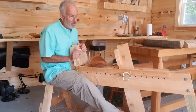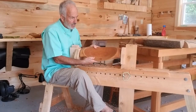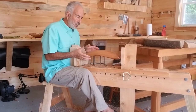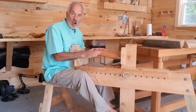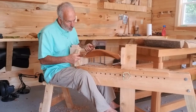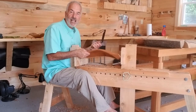I also want to show you how I use the draw knife and the carving horse to fine-tune even more of the product. This is the carving horse, and I use it quite a bit in the process of making my bowls — it's really flexible and convenient. I can take a bowl, put it like this, hold it, work on one side, flip it, work on the other side. It gives me a lot of flexibility, not having to deal with clamps. I take away a lot of the bulk with the carving axe, and then when I want to get more of the shape, I use the draw knife. That's a great place where I can go along the edges and the sides and really get a nice surface to where it's almost exactly what I want.